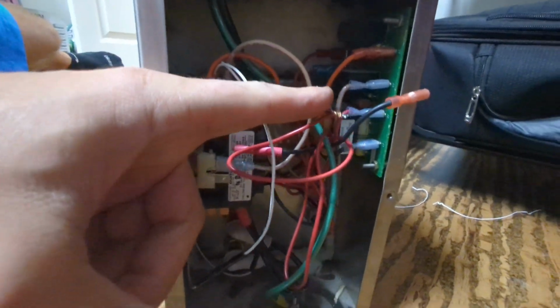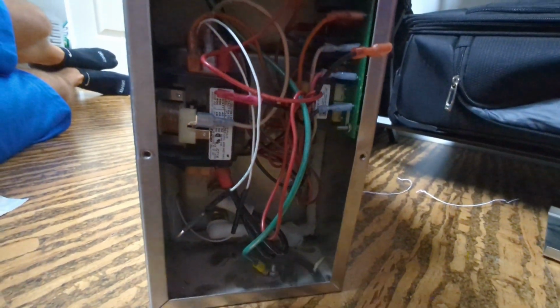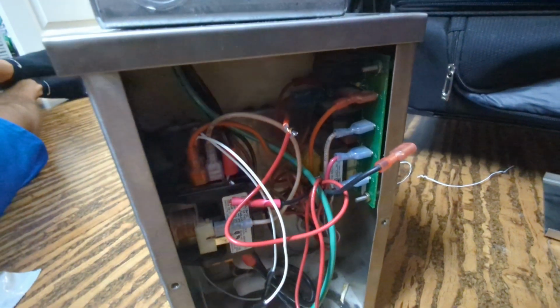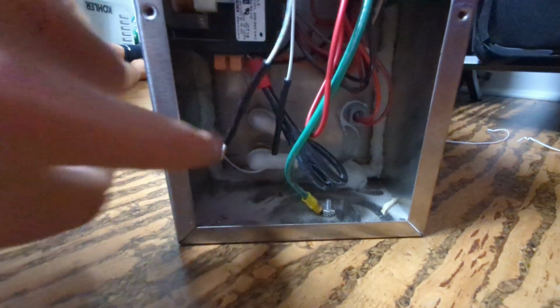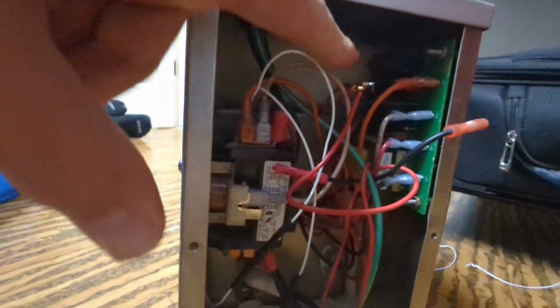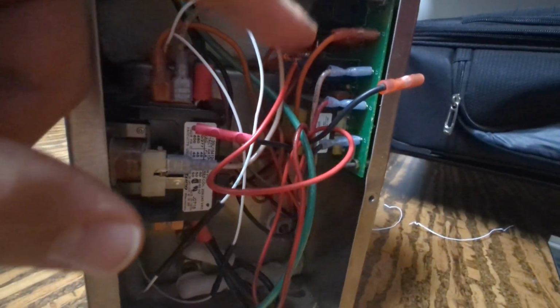And so I bypassed the temperature fuse here and connected just the level switch. And you can see the level switch is down here. You can see the heating elements, and just above that, if you can see that brass nut that's just above that white cap. So the white cap's the two heating elements, right? And then that's a 1/4 inch NPT. Now you can take that out and plug it and bypass the temperature fuse, which is what I did here just to test it.